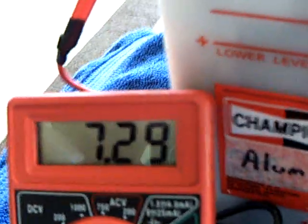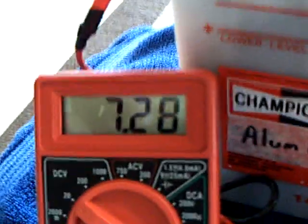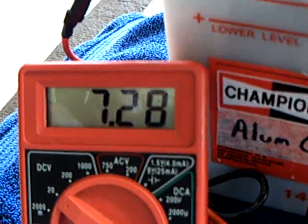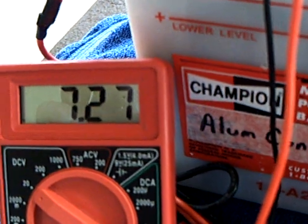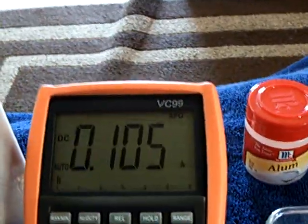What you can do now is watch that voltage drop off, take time intervals, log it, and chart it — do the old school charting on the discharge curve. Where John was using a computer, I can do this on just graph paper if I want, and just take a look at how long it takes for that to drop off while watching my amp draw at the same time.